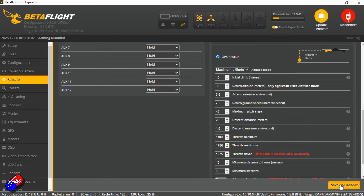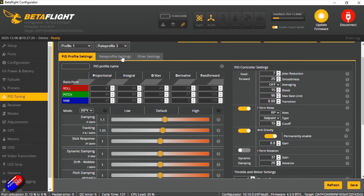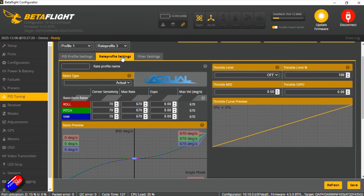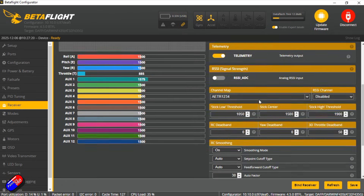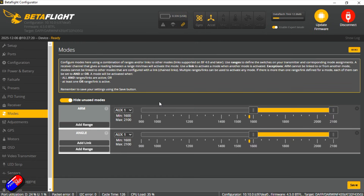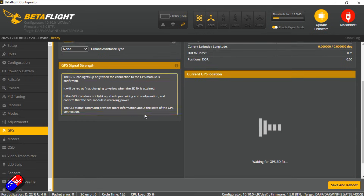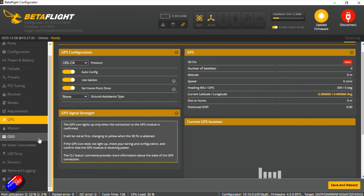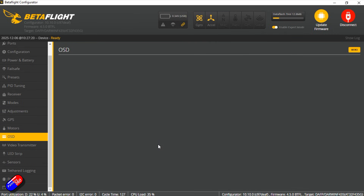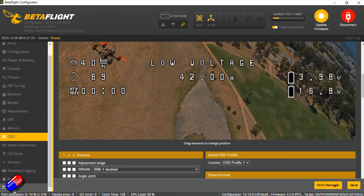Don't forget to set your hover throttle correctly for how you're flying it. PID tuning looks good — dump and diff are in the description below if you want to look. It's set up to be a very stable, relaxing flyer. Receiver is set to CRSF via UART. I tried to bind using the bind receiver button but ended up just adding a bind phrase, powering the quad and leaving it for 60 seconds. You'll need to sort out your modes. GPS got a lock very quickly outside — under a minute from a cold start, which is great. The OSD will need a little bit of work to lay it out how you like.